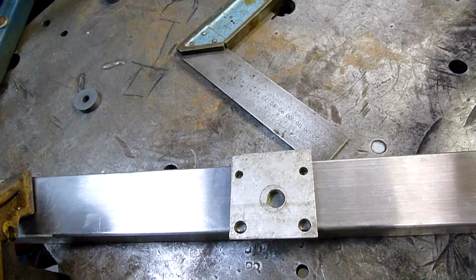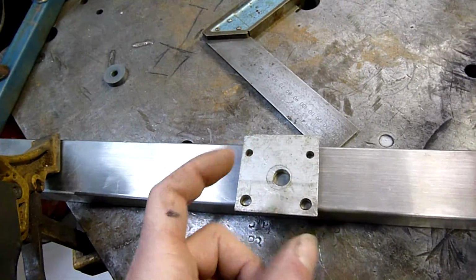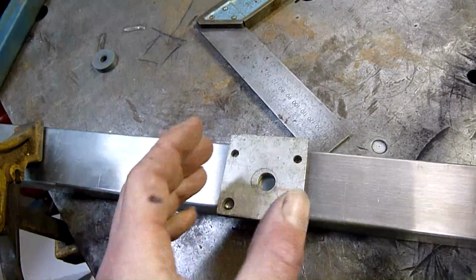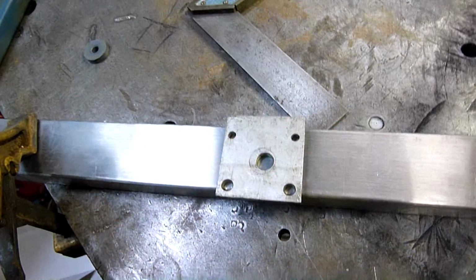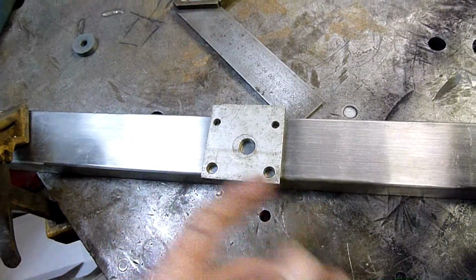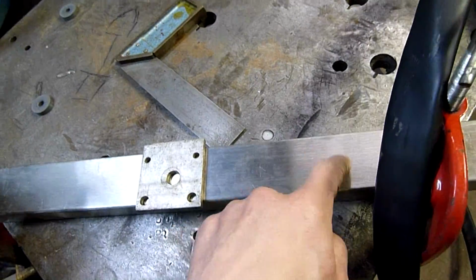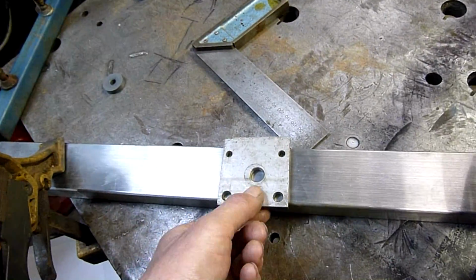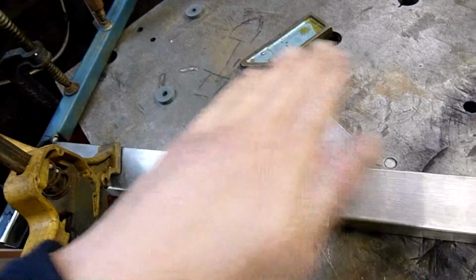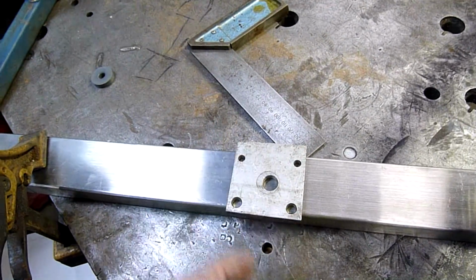This is a job I've got one of the guys at work doing at the moment. We've got two pieces of 40 by 40 stainless steel angle that are about 700mm long, and they have to be welded together back to back, so we've got a flat T-shaped profile. Trying to weld across the top means you've got to grind all the welds back, and top and bottom you're just going to warp it. So he's drilled 10mm holes every 80mm or so along the length, and filled them with the MIG, welding the two together, and they're ever so slightly domed on the top, but that's not important because it's a bench seat. If anything, it actually works in our favour. So yeah, that's an example of plug welding.